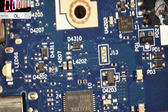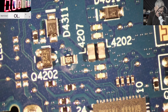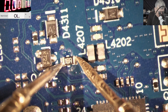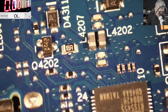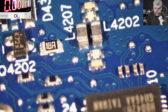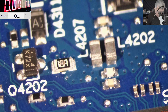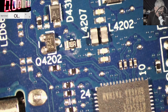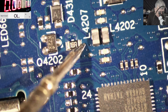So what we have to find is the 3.3 volt power supply. Wait - why is that resistor looking weird? It's burned - I can't believe it. It looks like a 10 ohm resistor but it's reading 150 ohms. It has a burn mark on it. So we're checking ground before and after the resistor. Here we have 84 ohms and here we have nothing - 84 ohms is not a low resistance.